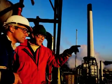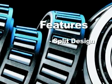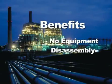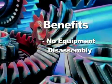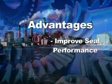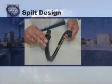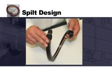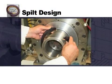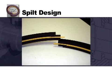The 33K can be used in many applications, including bearing protection for pumps, gearboxes, and rollers. The 33K split design eliminates the need and associated costs for equipment disassembly while improving the seal performance of conventional lip seals. Unlike conventional lip seal designs, the 33K split design dramatically reduces valuable installation time by eliminating the need for a complete equipment disassembly.